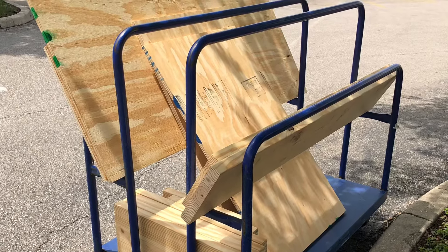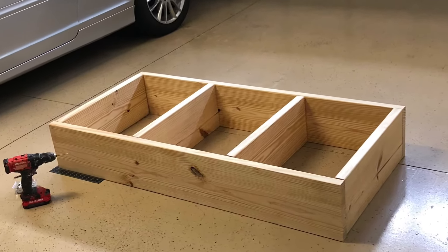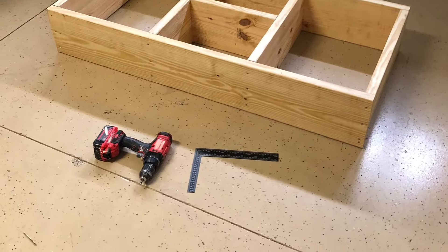You're going to need one 4x8 piece of good finished plywood for your top. Bring it home, lay it out the way that you like — a little larger than your washer and dryer. Measure depth, width, and add an inch and a half to two inches.